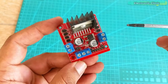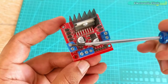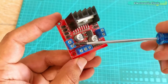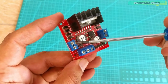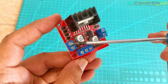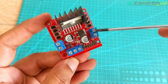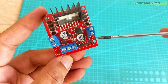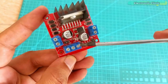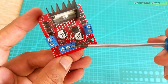Let's take a closer look at the pinout of the L298N motor driver. This module has three terminal blocks. This terminal block will be used for motor A and is clearly labeled with OUT1 and OUT2 — this is where we connect the two wires of the DC motor. This terminal block will be used for motor B and is clearly labeled with OUT3 and OUT4, while this terminal block is labeled with 12V, ground, and +5V.